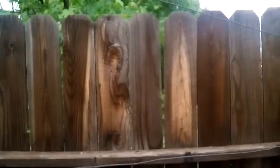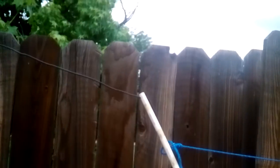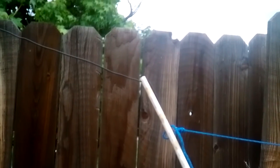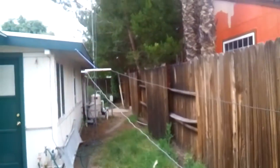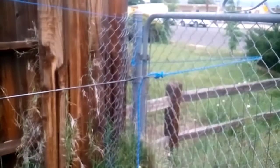The wire comes down like this. This is a small yard, that's why I'm doing the 80 meter Z antenna. It comes into a PVC pipe — that's a 12 inch PVC pipe. You roll both ends, feed the wire down, come back down to one side, back over to another PVC pipe, come back down here, and tie it off where you're going to tie it.